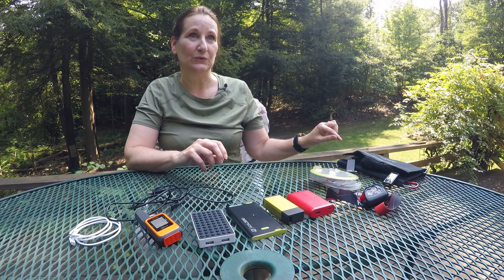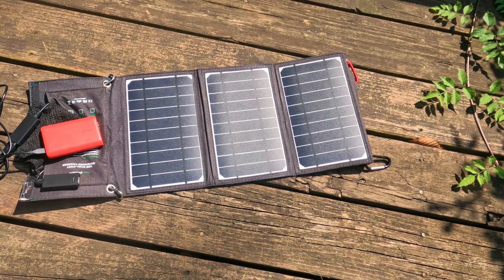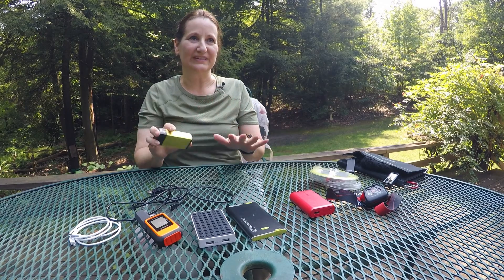Here's what you need to know about charging devices with a solar charger: you generally cannot plug your device directly into it. Most phones and other electronics need a steadier charge than that, so you have to plug a power bank into the charger, then use the power bank to charge your devices. So if you're only going to be gone a few days, just bring a power bank — you'll have to bring it anyway even to use the solar panel.